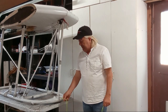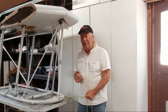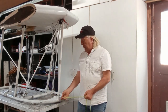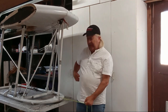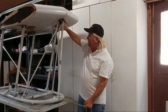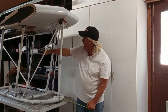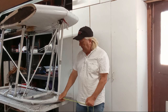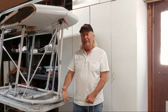When we actually got it off the ground, pulled the nose up, and started flying — on the first flight, looking at the CG I used at Marina which worked well there — it took me full forward stick just to hold the nose down. With all the force being applied down low, this isn't going through the CG, because the CG is actually up around my carabiners, somewhere mid-chest — we've got 115 pounds of glider up here and a 200-pound pilot below. So all the force down low was causing quite a nose-up pitching moment. We moved me one notch forward, and that compensated for at least half of it — on the second flight I only needed half forward stick.